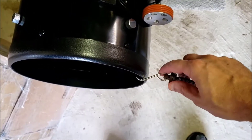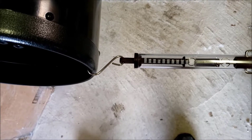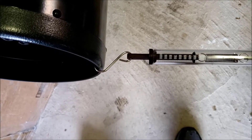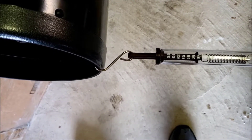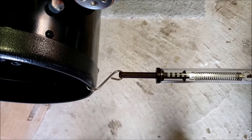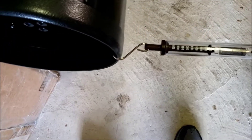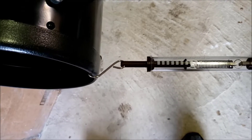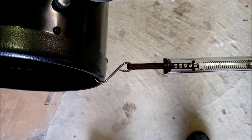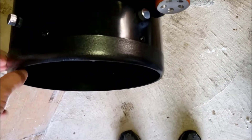To show you what I mean, I have a scale here — a spring-loaded scale usually meant to weigh things, so it's in grams. I'm going to put a sideways load on this and see how hard we have to pull before it starts moving. We're up to 400, 500, 600, 650, 700. So we need a side load of about 700 grams — I know I'm using the wrong units, but this is all I have right now. Let's try again to see if it's repeatable: 600, 650 — last time it was 700. So about 700 grams to get this thing to start rotating. Once it's moving it's pretty easy, but let's go ahead and take the mount apart and see what we can do.